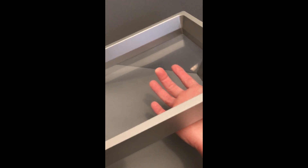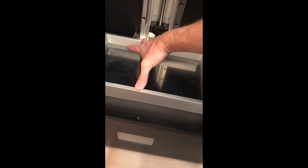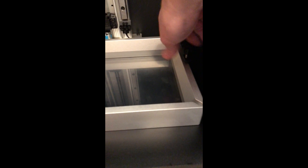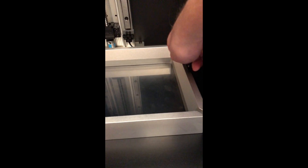The FEP is good and tight — it's clear. One thing I did notice is that even though the vat is perfectly flat, it will rock when I put it inside the Phenom. This might be due to the tape around the LCD screen; I'm thinking about peeling that off and replacing it with Kapton tape. When I do the exposure test, the screen looks fine — it's all clear, nothing wrong in that area, so I don't think it's an LCD issue.